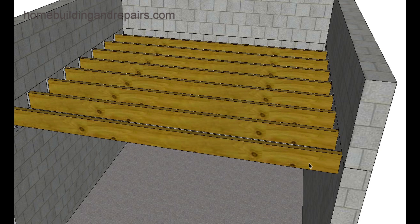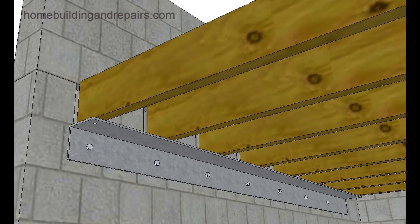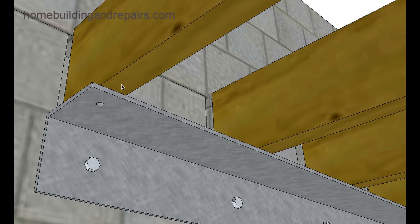Another method that might work after you've replaced the joists and slid them into the slots would be to use some type of metal as a support — it's common to see metal supporting joist or roof framing members. The only problem is you don't know what's inside the block wall. If it's an older building, you could have mortar that's real weak, and something like this might not work. This is something you would need to contact an engineer on. You could drill a hole underneath to drive a screw in, but I don't work a lot with metal. A lot of the times the hangers would be welded onto the metal.